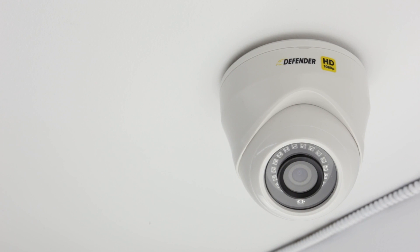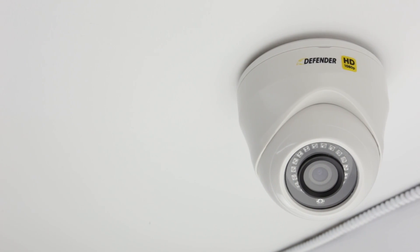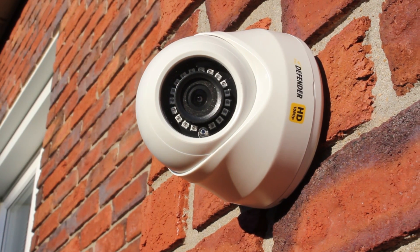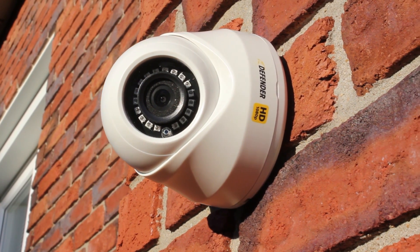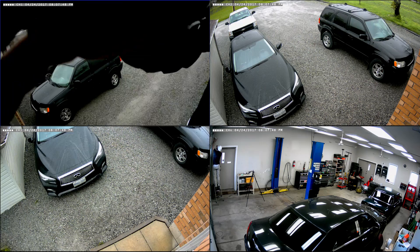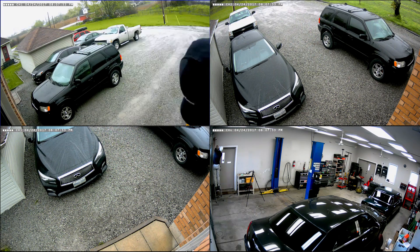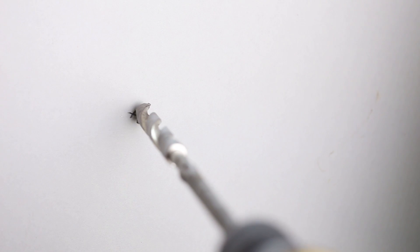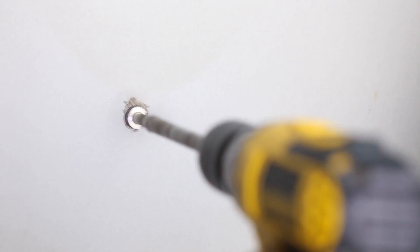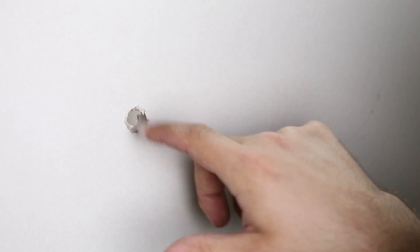Installing the wires cleanly and hiding them in the walls makes your cameras much more difficult to tamper with. Step 3: Mounting the cameras. The remainder of this video will demonstrate how to properly complete an in-wall installation. Prior to installing, position the camera where it is to be mounted to ensure the best coverage area. Watch for any potential glare and adjust accordingly. Drill a hole precisely where you'd like your camera to be mounted — no bigger than ¼ inch — so your camera completely covers the hole when installed. Clear any debris from the entry points and feed the wires through the wall to your mounting location.